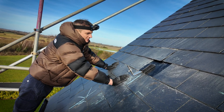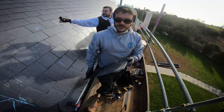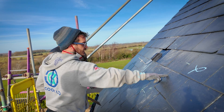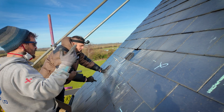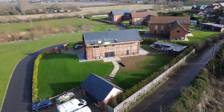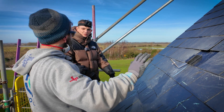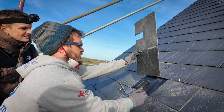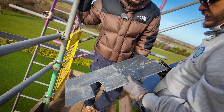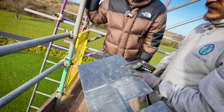These are genius — lead flashing clips. This is another cost consideration because sometimes these just break. When you're pulling a tile out over here, one can fall out over there — not the whole tile, just a piece — they just get a fracture. There was one on the other side of the roof where all the tiles looked fine and then all of a sudden a tile just fell out and we weren't even near it. It's just because we're walking around on it — it gets a little bit of movement. You don't grind this? No — you can do but you go through batteries. It's like cheese.